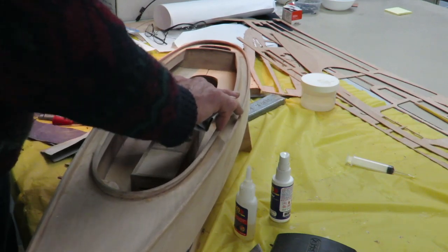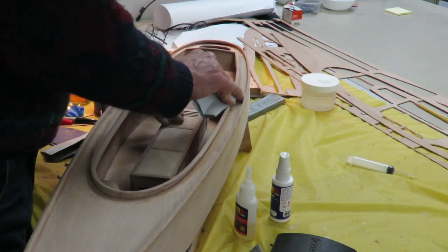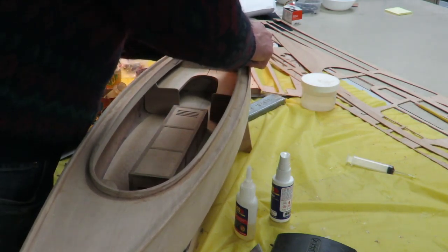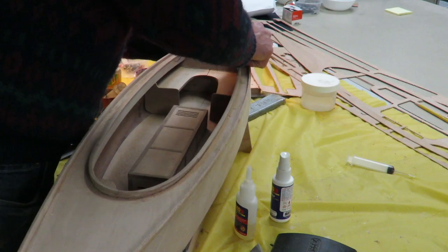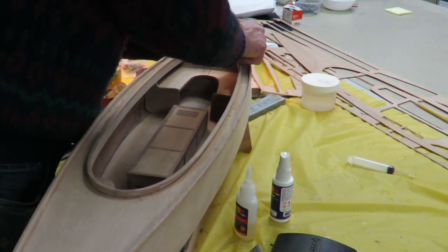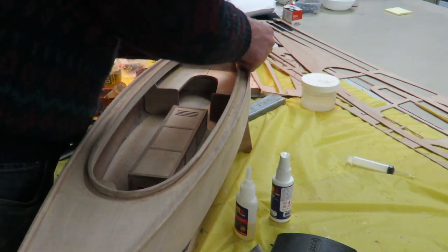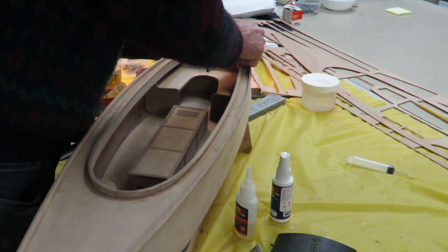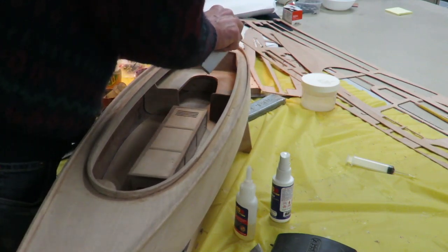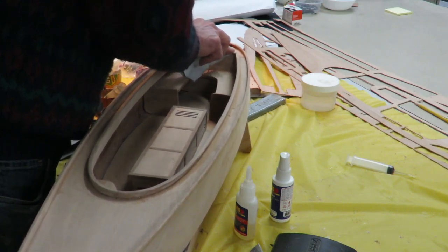That's the other thing. The more sanding you do with the 220, the more elegant it's going to keep getting, prettier and prettier. And as you sand the corners, make sure you sand off any surface epoxy that comes up, so you have just the wood with no epoxy on the mitered corners. Always try to sand with the grain. It's a little difficult at the corner, but you might finish up sanding with the grain right up to the joint on each surface, so you're sanding with the grain even into the corner there.